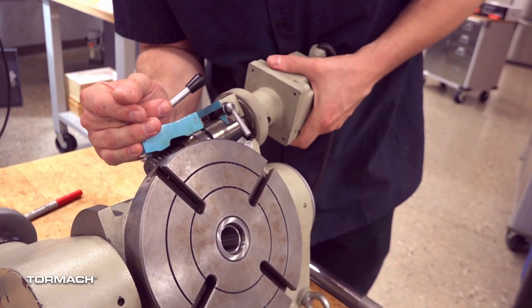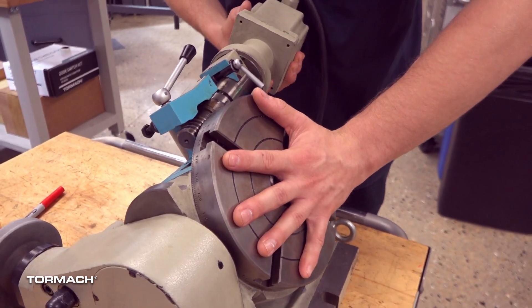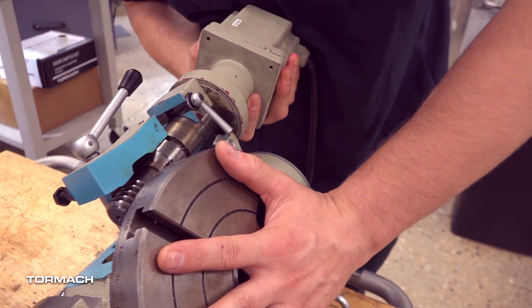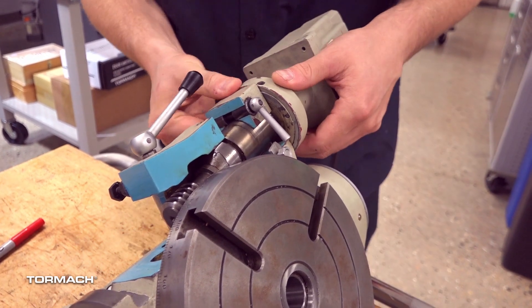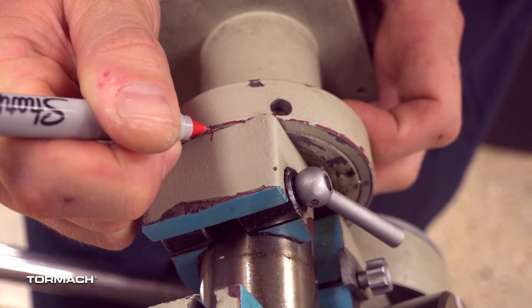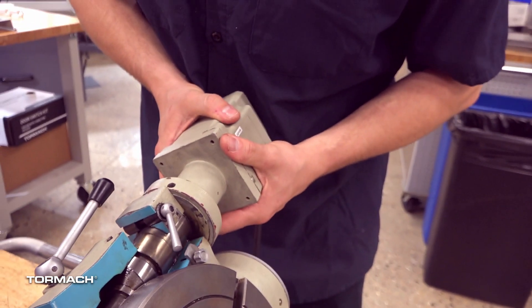The way we like to set these up — we want real-world output, so we're going to do it the way that works. We're going to take our hand and rotate our faceplate until our gear and our worm engage. We're going to tighten it lightly into position — you don't want to over-tighten it. Then we're going to draw a line between the motor coupling and the casting holding the eccentric. We want just one thin line. Once that line is established, that's our set point.